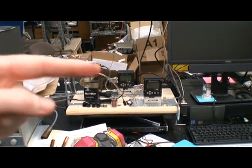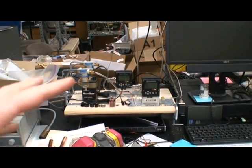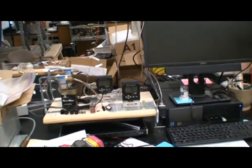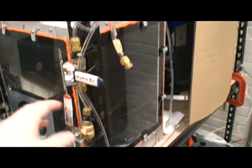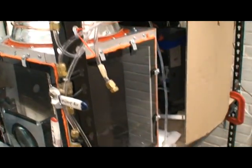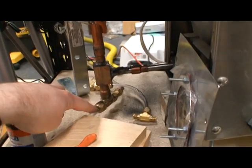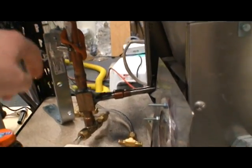So we have air in the back and methane here, so you just set whatever you want to flow in terms of the gases. So you can calculate your equivalence ratio, and then that will flow up to the ceiling, over and down. You have shut-off valves here and here for those two gas lines, and they combine here at the bottom and then flow up into the burner.